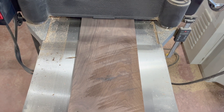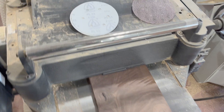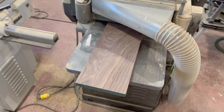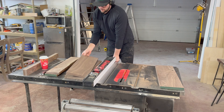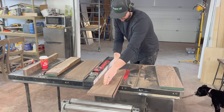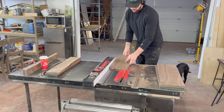Once that's done, I then take the pieces to the planer and run them through. I finished with a final thickness of about 13 sixteenths, and the pieces all turned out to have some really fantastic grain in them. Then, once I had that flat edge and two parallel faces, the final step is to take the pieces to the table saw and rip each one to width.